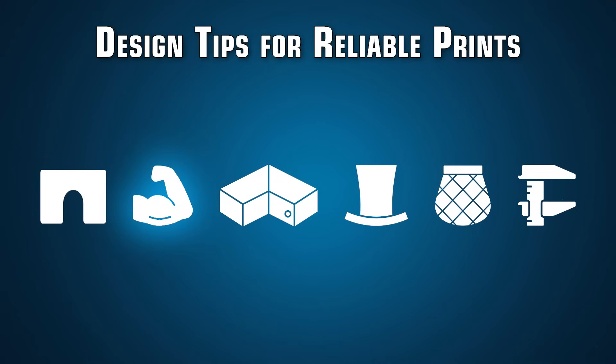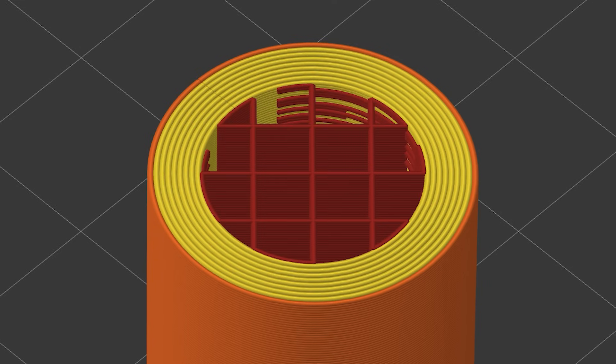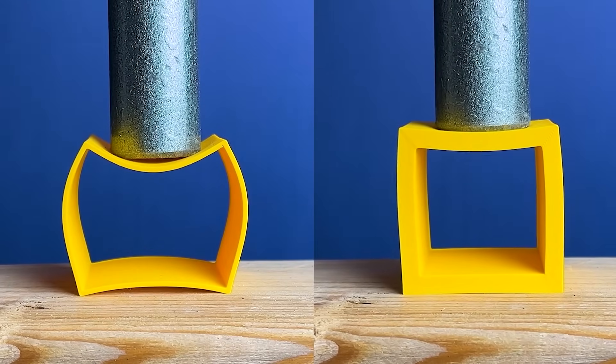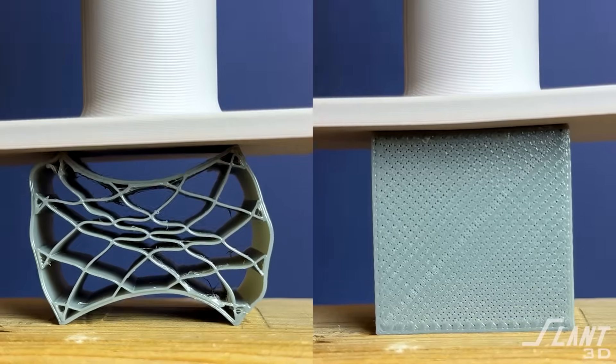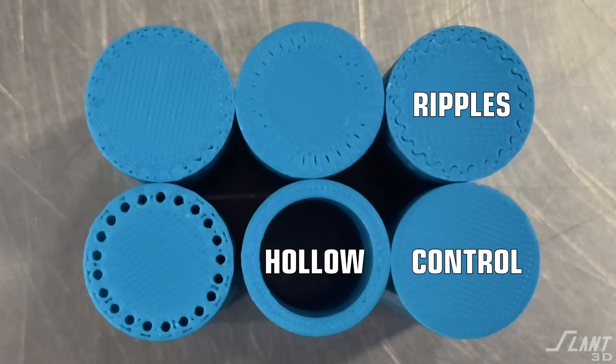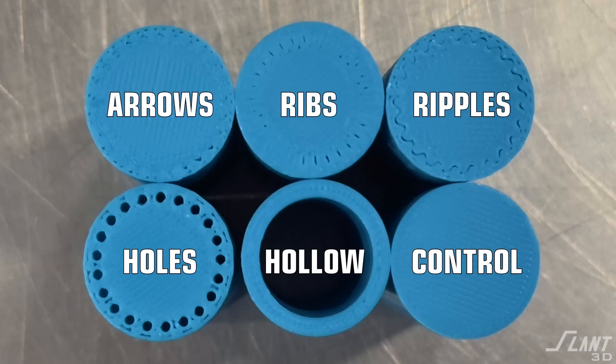Next, strength. 3D printed parts are a little bit weird — this part is weaker in the vertical direction than it is side to side. So you want to make sure you have the density or wall thickness that you want. Normally this is done inside slicers — you make the wall thicker to make it stronger on the outside, kind of like an I-beam, and you might increase the density of infill. But neither of those are particularly very good. A better way of getting strength in the walls is to put in what we call micro features on the outside inside of CAD, so that regardless of slicer settings it will always have the strength you want.